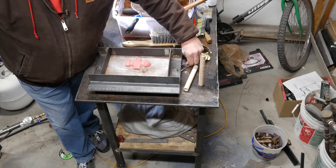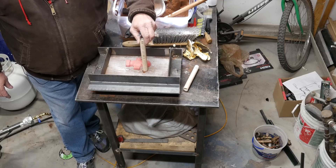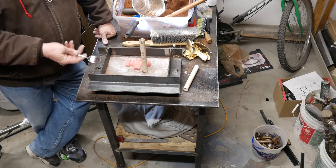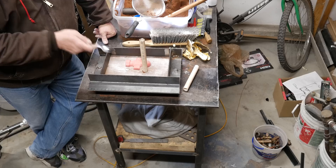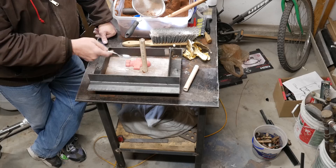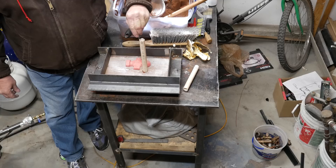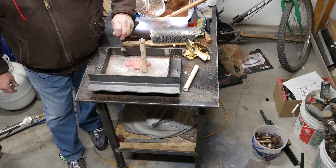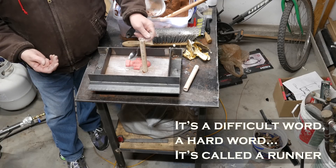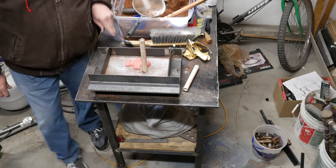Then we're going to run that through a couple of gates that run over to two risers. The idea with the risers, as I'm learning, is not just to vent air but really to supply molten metal to the part as it's cooling and help it fill in. So we're going to put in two risers this time, gate over to them, then gate into the part itself. I might also cut out a couple of reservoirs on the side to make sure I'm getting good flow through it.